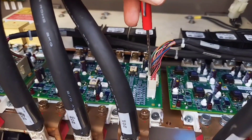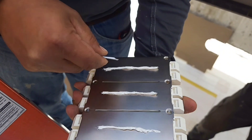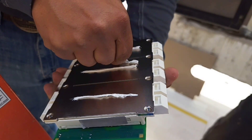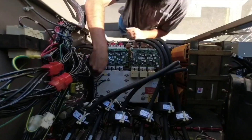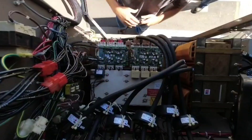When you're doing that plug, make sure you take a flathead screwdriver and push those pins down in there so you get a really good seat. Be very critical that you put the thermal paste on really well and get that whole bottom side covered, and that you're tightening down the mounting bolts evenly.